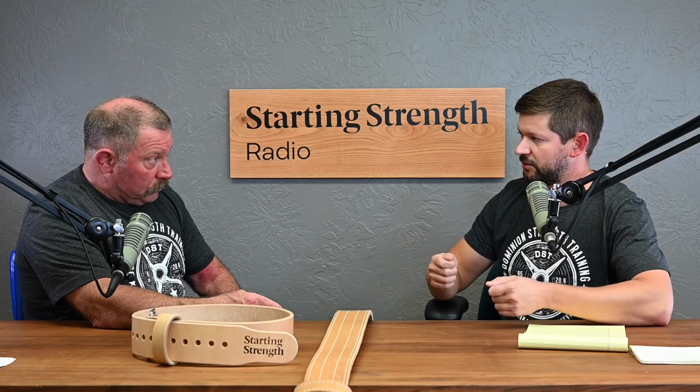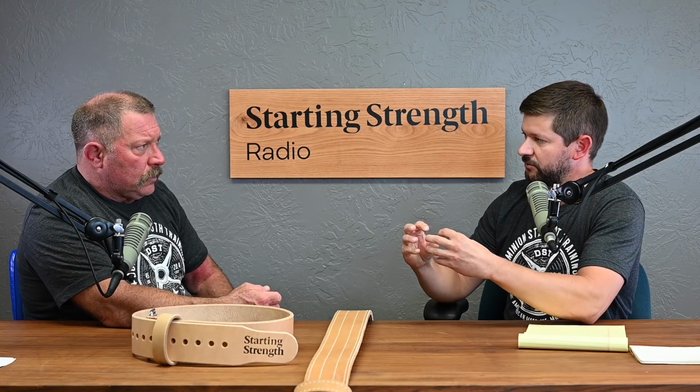I think it's eight 3-inch straps at one time, so at that point you're almost the whole width of the hide. So you don't really have a problem with the work trying to turn on you, because you've got so many cutters going into it at once, and you're stabilizing the one adjacent. Those cutters are just bearing down on a plastic roller underneath. So there's not really anything to do other than feed it through as straight as you possibly can.